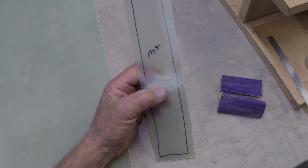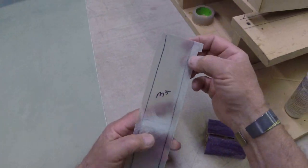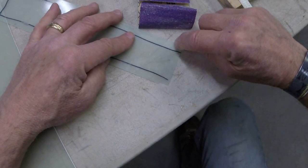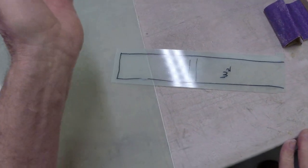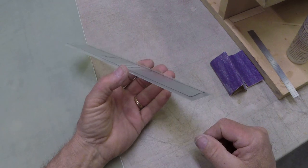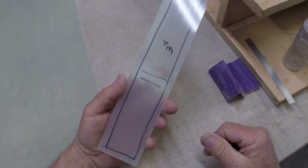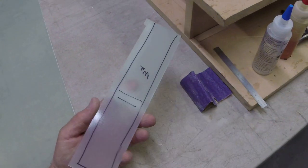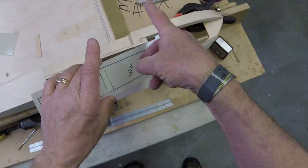I'll spend some time on that until you get sick of it. Cross-hatching this thing everywhere that it's going to attach, okay? You're also going to, I should have marked it, do it right across here too, where that piece of 1 millimeter is going to lay right there, okay? The bottom part here, nice and shiny smooth. Later when we're getting ready to shoot the boat, we'll probably just do a real light scuff on this here, because we're just going to shoot everything, and then we'll come back and scuff that light again. Might even want to just tape it off, because it's done.